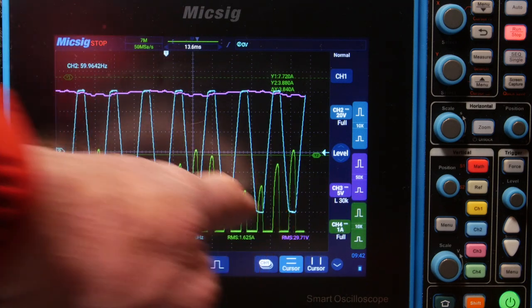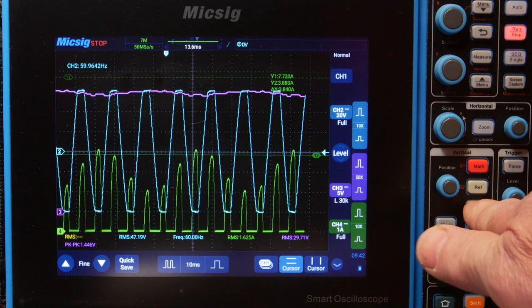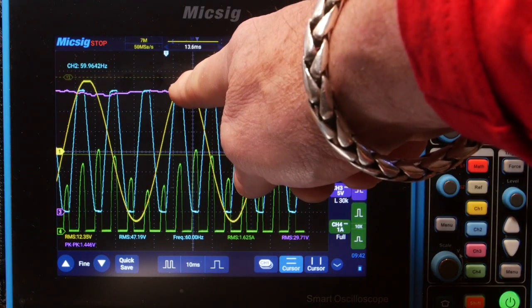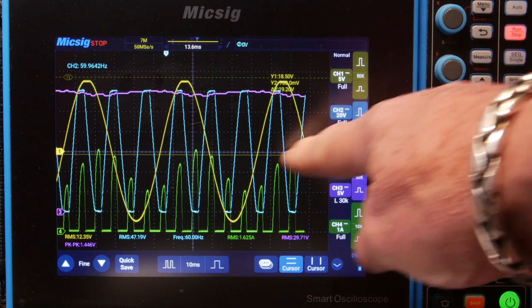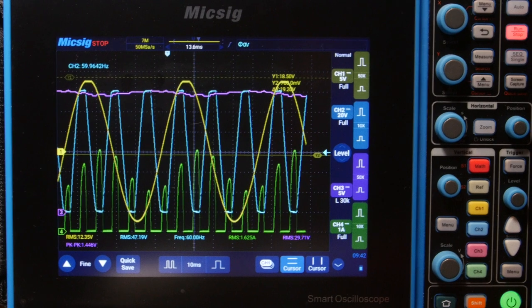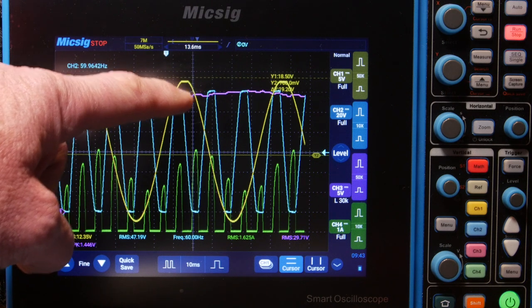See how the space between them when the rectifiers are turned off? You know what, if I turn the voltage back on — still we're only seeing a little bit of clip there because these voltage waveforms here, it's 20, 40, 60 volts. Still just over 60 volts. And that's about right because remember that calculation we did in the previous video — we came out with 31 volts peak. And this is across both windings, so it's about 62. We're getting about 31 on each side.